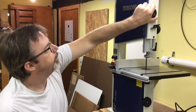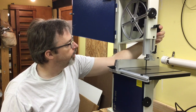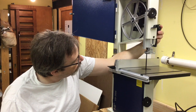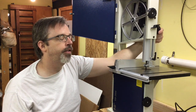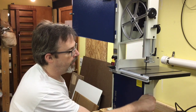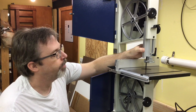There is one problem I found. Most saws will have a rack and pinion system that raises and lowers the upper guide, and this one does too — it moves nice and smoothly. But I have found that it is not actually perfectly parallel to the blade. If I go from all the way at the top down to all the way at the bottom, I probably have about a 32nd of an inch difference where it's sliding over just a little bit — the bearing is closer to the blade at the bottom than at the top. I double-checked the guides at the bottom to make sure it's not touching down there, and it isn't, so the blade is not being deflected.